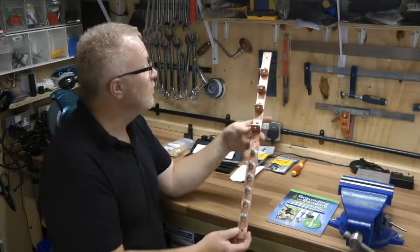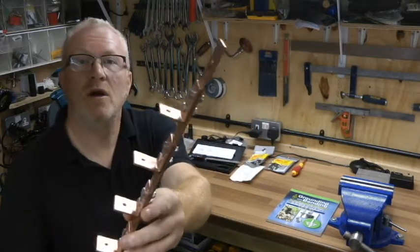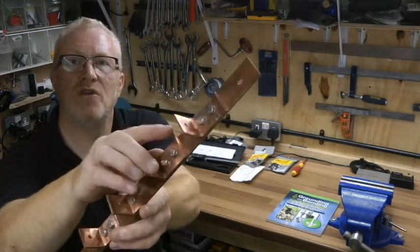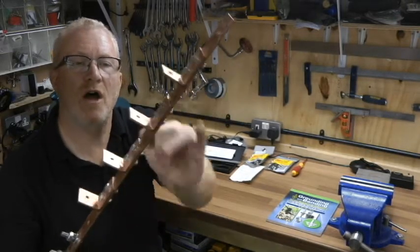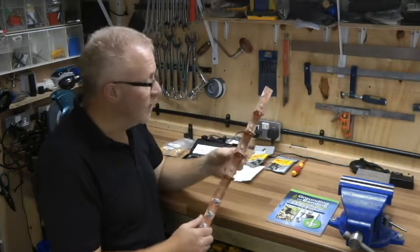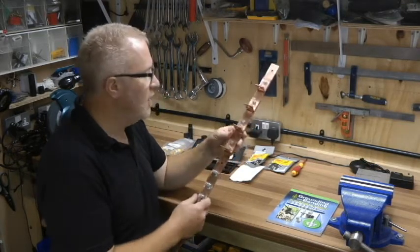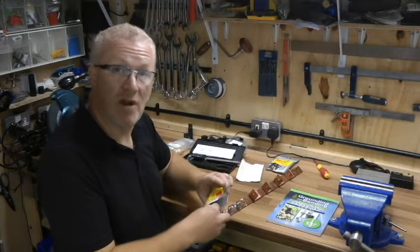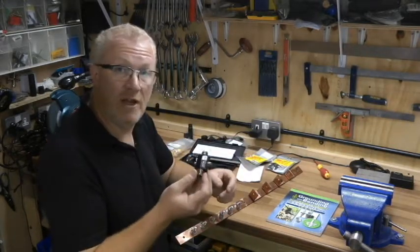You can see at the top here — I've actually cut small sections off of the bar. I've got four of those, and I'll explain what they're going to do. After cutting them, I literally just put them in the vice and bent them over, so they're right-angled brackets. These I designed to mount lightning arresters on — I've got a series of lightning arresters for different antennas.